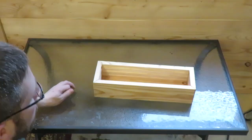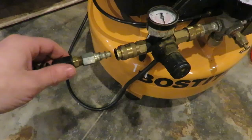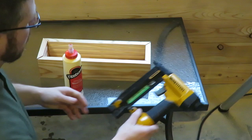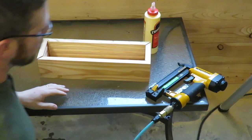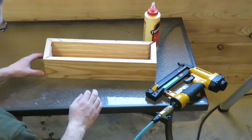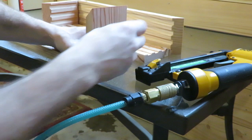While it's all dry fit together, grab your glue and your nails. I'm using a brad nailer with 1 inch long brads and glue. If you want, you can use a screw gun and screws. I'm just going to make sure I always nail it from the 5 inch wide side, so that way when you're looking at it from the front or side angle, you don't see nails — you're only going to see nail holes from that side. Apply some glue to the ends you're going to nail together.